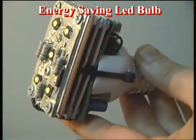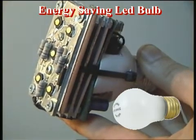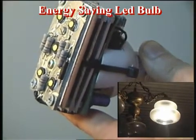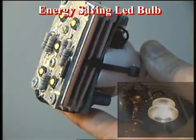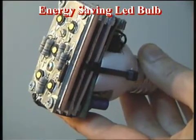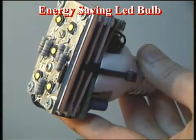If I had to run a lamp of 40 watts five hours a day, that means I spend 200 watts per day. The month has 30 days. 30 days multiplied by 200 watts equals 6000 watts, or 6 kilowatts. This is the consumption of only one lamp — how many bulbs do we have at home?